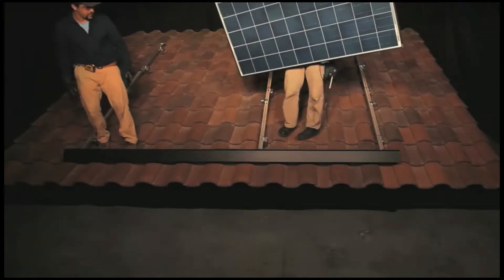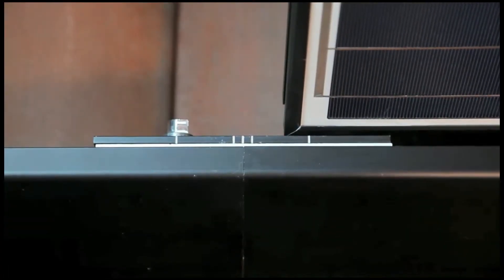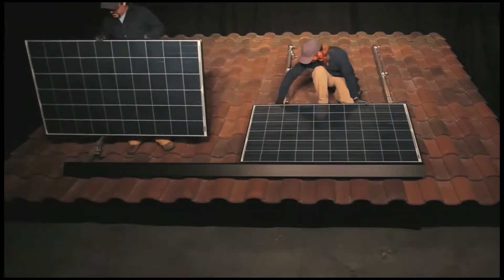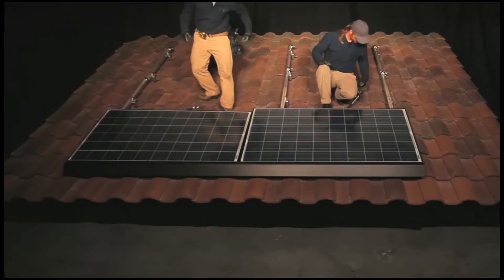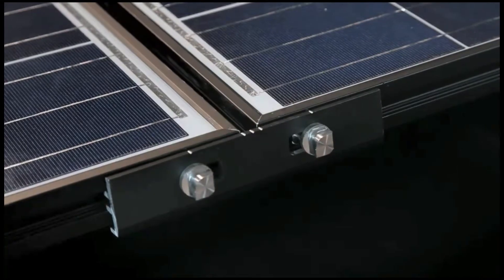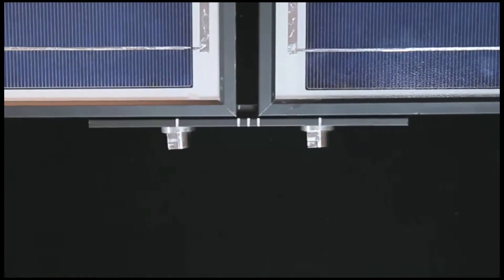The array skirt is now ready to accept the first row of PV modules. To install a module, place the groove along the module's lower edge onto the tongues of the front row cam feet and interlocks. Use the alignment marks on the interlock to position the modules and maintain consistent spacing — the marks are about half an inch apart. Then pivot the modules downward while applying pressure down roof, causing the module groove to seat on the tongues of the cam feet and interlocks. Couple the modules along the top edge by installing an interlock at the module's seam. Insert the interlock by hand into the groove at a slight angle, making sure to maintain a consistent gap between modules by referencing the alignment marks. Use the zep tool to turn each zep from position 1 to position 3, aligning the numbered timing marks on the zep tool and the timing marks on the interlock.